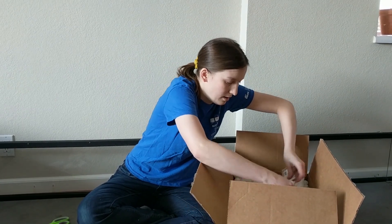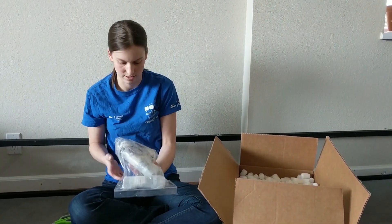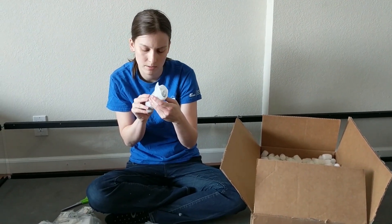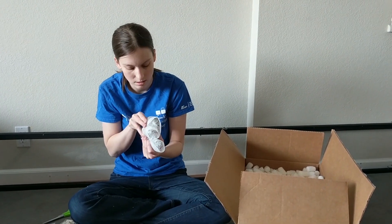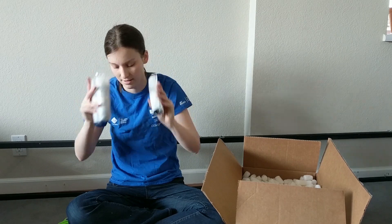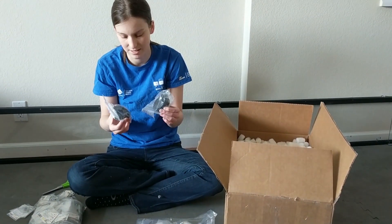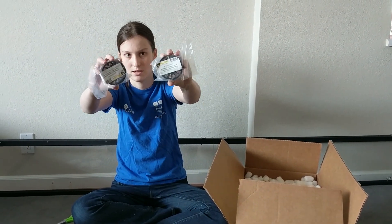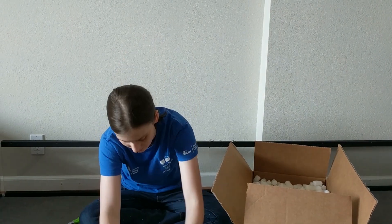A little plate here, and some spacers. This is heavy — a hyperhub! It looks like this is a 13.7 to 1 ratio planetary gear motor, and there are three of them. These are heavy duty — that'll be really nice. We've got cords for that. These are 3613 series compliant wheels. They're actually kind of squishy wheels with little rubber structures. That's really cool. And a lot more wires to go with that.